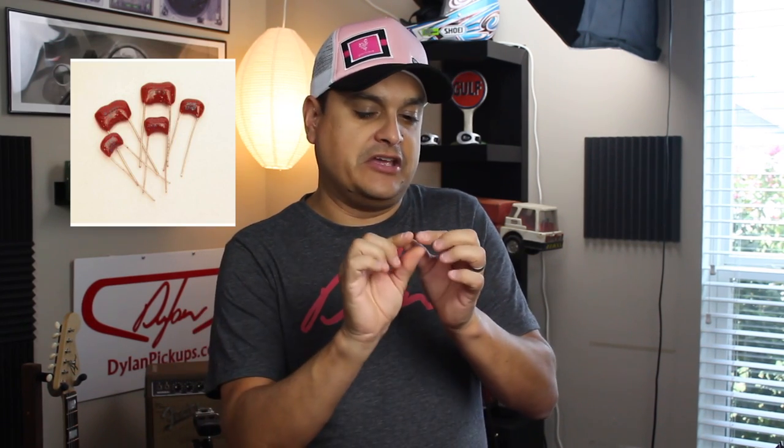How much difference do each of these materials make? Here's something really weird about capacitance: even though there's a gap with that plastic, oil, or whatever in between, electricity can still flow across there. That's called the dielectric of the material. Each different material — the polypropylene (the little orange ones), the oil (the little ones that look like cans), the ceramic (the little disc-shaped ones), or the silver mica (the little green or brown chiclet-looking ones in lower-priced guitars) — allows electricity to flow across that gap in a slightly different way. Scientifically, it can make a difference in the sound of the guitar.